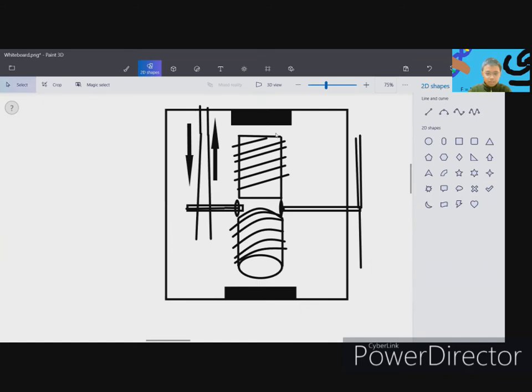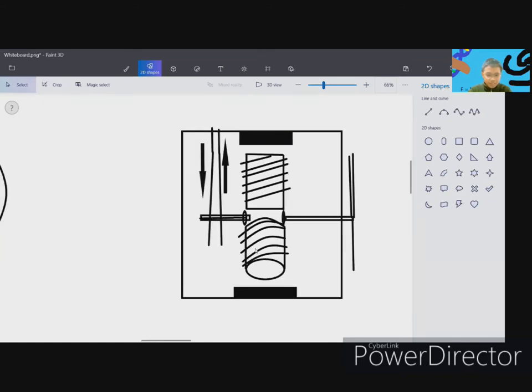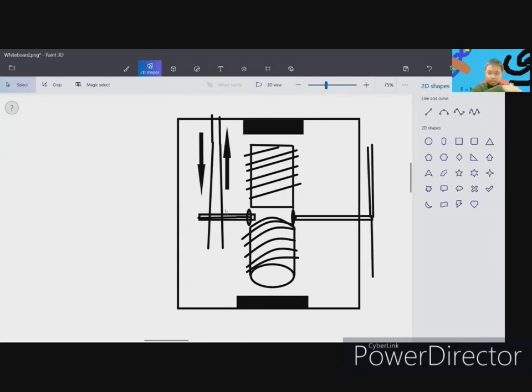So, these black boxes on the top and bottom are magnets. And there's a rod in the middle. It's actually made of two parts, with a membrane separating them in the middle. A current goes here, and up here, so that when this thing turns, one side of the rod will have one charge, and the other will have a different charge. And then when it turns, basically they flip sides, and then the charge is different. So these things here are rods of iron with wires wrapped around them. These wires are also connected to the shaft.